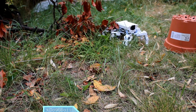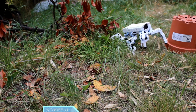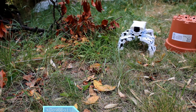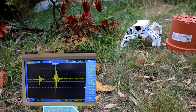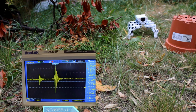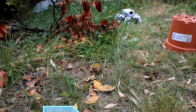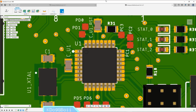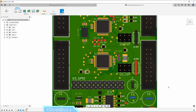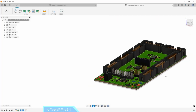in a circuit. My new, super fast, super twitchy servos produce more back EMF than my design could tolerate, resulting in the microcontrollers spontaneously resetting due to rail drops or even spikes appearing on the reset pins. This became so bad that it even led to the corruption of the microcontroller flash in more than a couple of cases. Hopefully this shit show is fixed by my new layout, and worst comes to worst, I'll slap some TVS diodes on everywhere. If the new layout fixes all of these problems, I'll be sure to talk about it. Probably. Maybe.